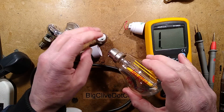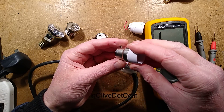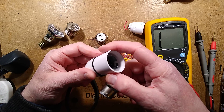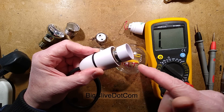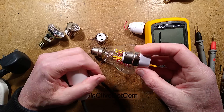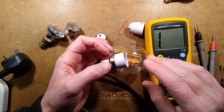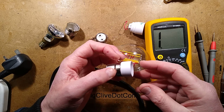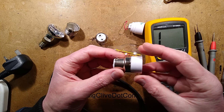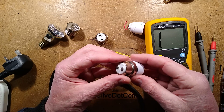And when you actually put one of these lamp holders — one of these faulty fixtures in, and they're all like this as far as I can see — when you put it into a standard bayonet cap lamp holder, if it's the conventional plastic one like this, all that will happen is that metal will either be live or at neutral. But if you put it into the metal chandelier, it will either connect neutral to Earth, which is a bit of a random thing with RCDs or GFCIs — it means that above a certain load you'll get tripping problems — or it will do live to Earth, which will instantly result in the power tripping. Usually the RCD trips first, or the GFCI.